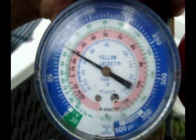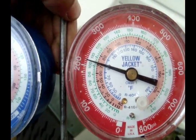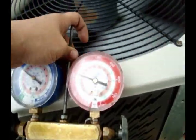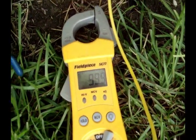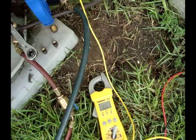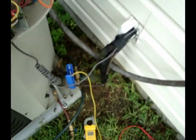We've got about 100 suction pressure and about 215 head pressure. It's about 95 degrees outside right now. 215 looks like it converts to about 104. Line temperature is just about 100, keeps bouncing back and forth between like 98 and 101. So I've got like maybe 4 degrees at best subcooling. Suction converts to about 56 — this is R22 by the way.